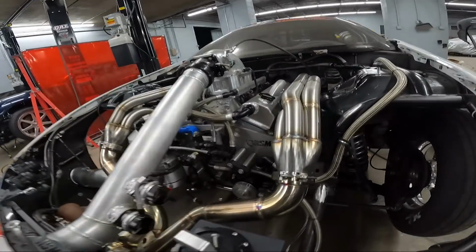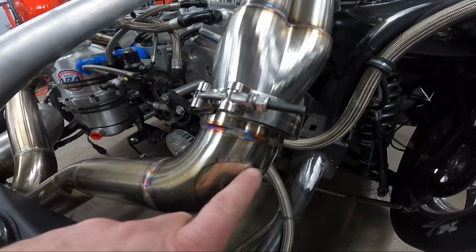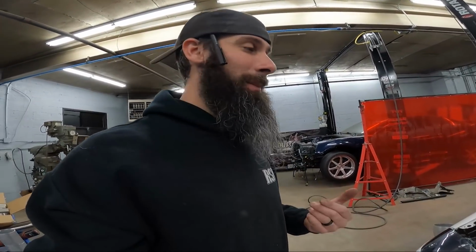And then before I pull the hot side off, I can just break the wastegates off. I'll have my traced out lines here where to cut out. Then I can put my wastegates back on, finish tracing the bottom, and then I'll know where to cut it out. And I can do everything pretty much off the car at that point, and then just put it on one last time whenever it's all welded up and done.